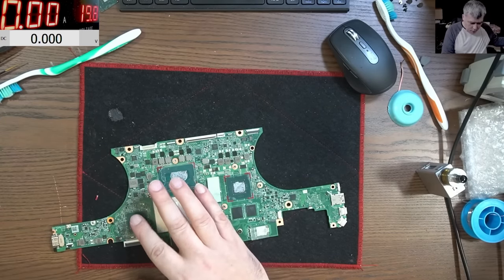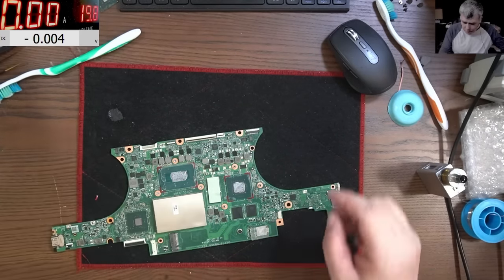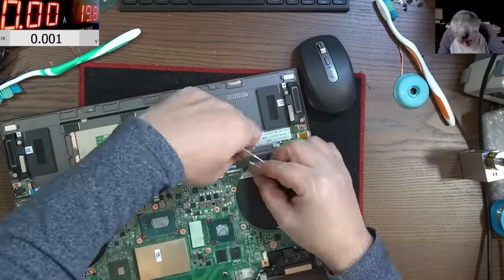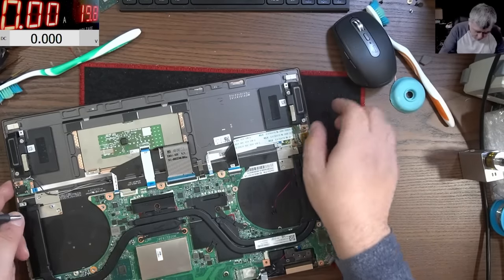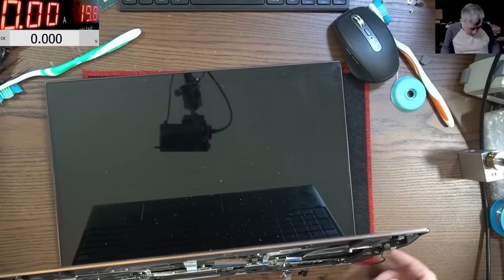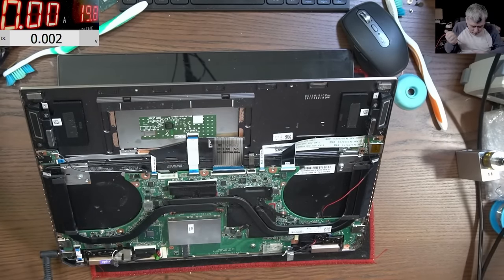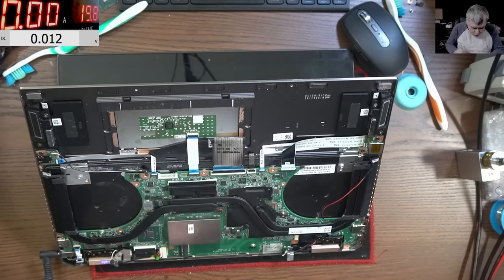First, let's check with the charger if our real-time clock voltage is present. But let's check with everything. Yeah, where is the power button? Is here on this corner, right? Yeah. So plug in the charger and we have the light. That's a good start. The 3.3 is present. Let's see. If I remember, the 3.3 was here. 3.3. We do have 3.3.